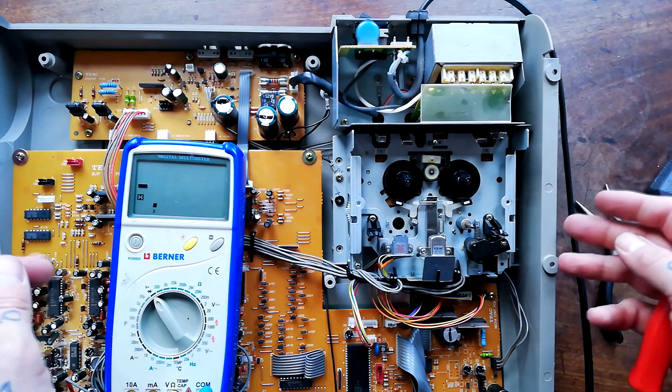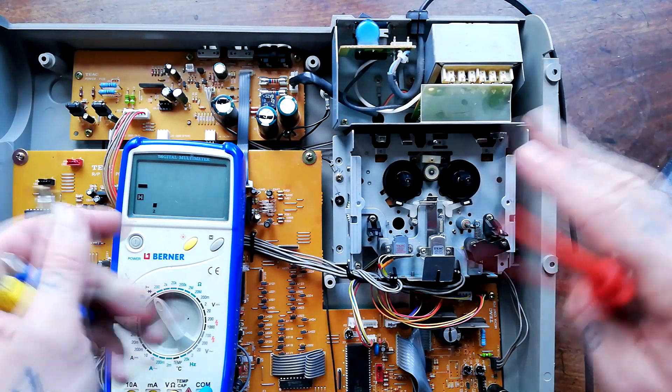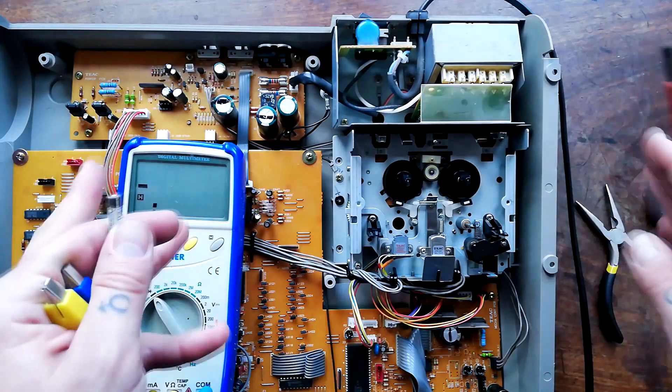In summary: if you've got a machine that doesn't power on, check for internal fuses and check the fuse in the plug. Much less of a headache if you can establish that that is actually the problem.